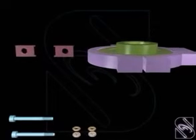The sheave contains eccentric bores to carry the crankshaft end. The two straps are used to enclose the sheave, and one of the straps has provision for connecting with the D slide valve. The sheave is assembled with the straps so that the projection in the outer periphery of the sheave is located in the recess of the straps.